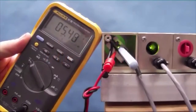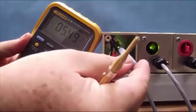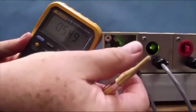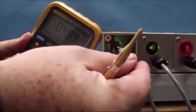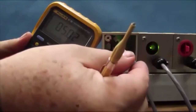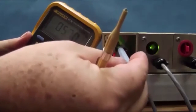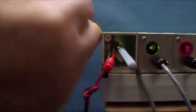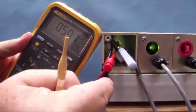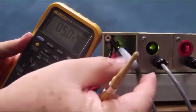So here you see that the final adjustment value is 5.5 volts using the capacitor adjustment blue screwdriver. The importance of adjusting in a clockwise direction is evidenced by turning the counterclockwise direction, and you'll find that we can go negative to 5 volts, which was our original starting point, and if we continue rotating the screwdriver in a counterclockwise direction, you can see that we will start increasing again. So this is that negative peak, and it goes positive in a V-type adjustment range. So what I'm doing is I'm trying to find the negative peak and then adjust it positively in a clockwise direction by 0.5 volts. So we're going to repeat that process.